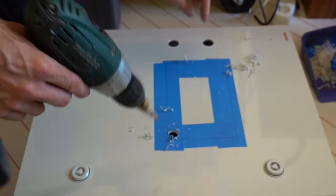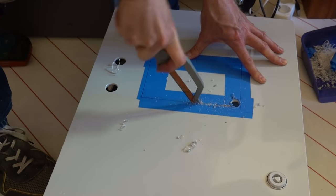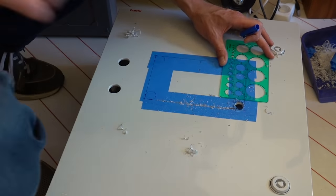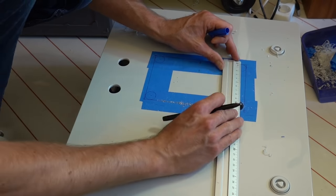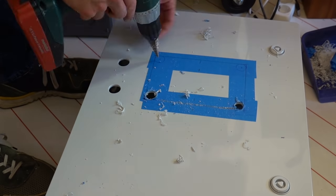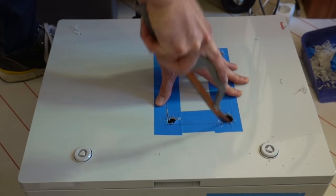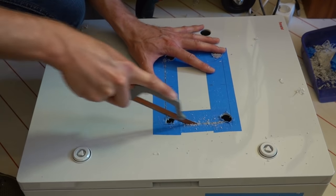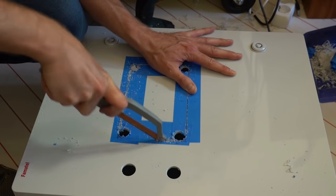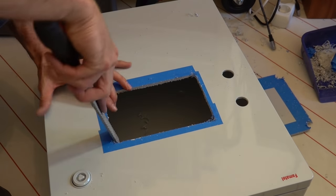The opening for the DDCS controller is made primarily with a mini hacksaw. This looks like a lot of work, but in real time it took only around 10 minutes to cut out the hole. Some filing was needed to remove the round corners created by the stepper.